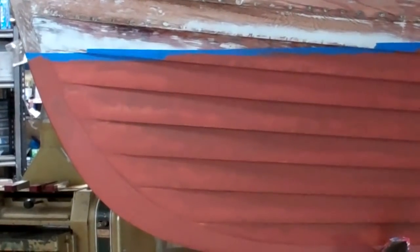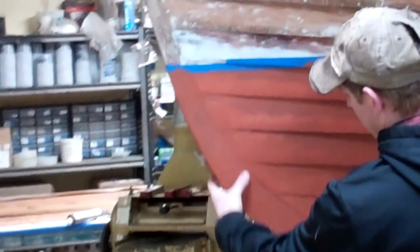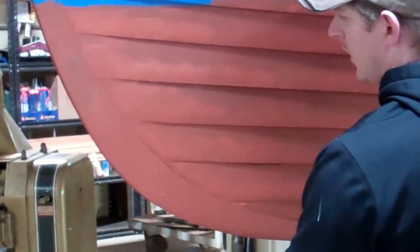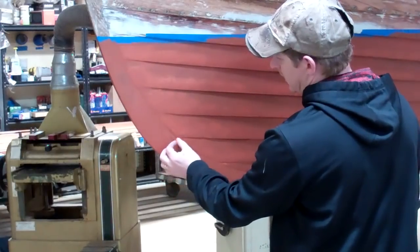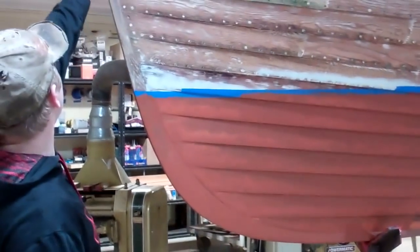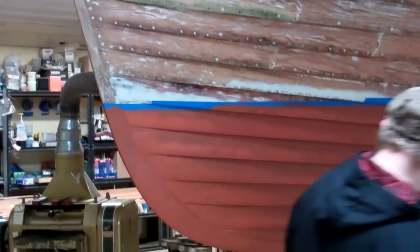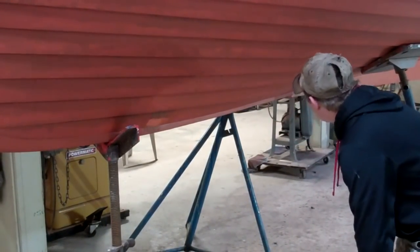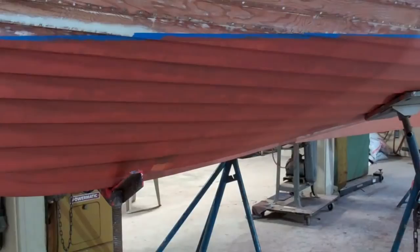While doing that, there was a Dutchman that John had to put in right here. This wood right here was all split and broken and cracked. There are some carriage bolts that go through to the inside — big carriage bolts with big heads on them — and they had just blown this piece apart. There's one that got put in because the front was all smashed up, and one along the bottom here because this was all smashed in.